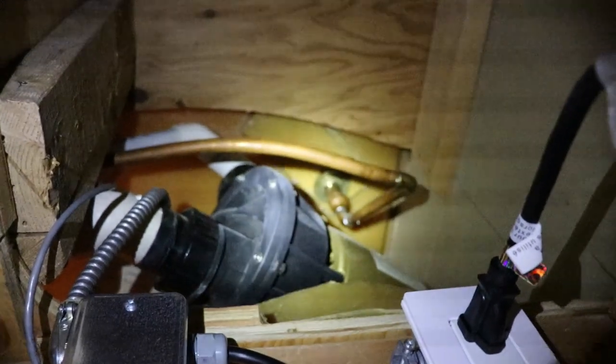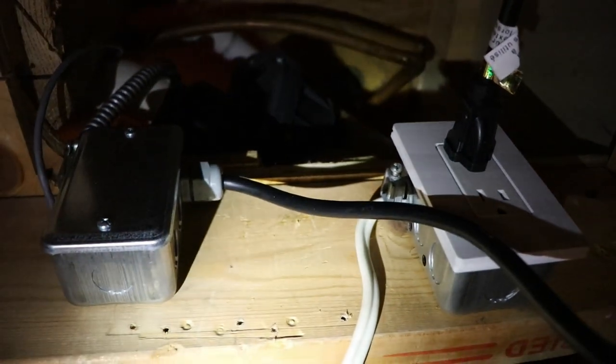That's where the last part of the puzzle comes in. You can kind of see that the motor is underneath the water spout - there's only one copper pipe there. If it was underneath the faucets in the center, you would see like two copper pipes with the valves and then a third one going over to the faucet. So this is off in the corner, it's not in the middle of the tub. I am going to mount that replacement box and then fish the controller up to the top using the old gray wire here. I'll just tape something onto it and pull it back up.